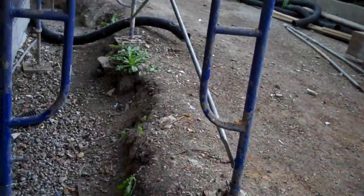No light — bummer. Here's a regular foundation vent; they cost $12. I thought that since I'm in a fire zone I probably needed a fire vent. This is a fire vent — it has a honeycomb on the backside. When fire comes up the hillside, as the flames go into the vent, the honeycomb material swells up and chokes the fire off so it can't get into the house. I called the inspector and he said yes, absolutely you need it, so that vent was $80.